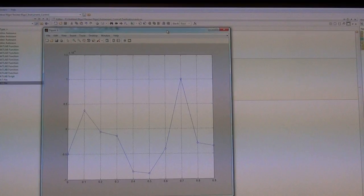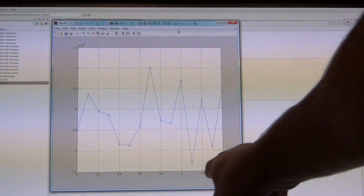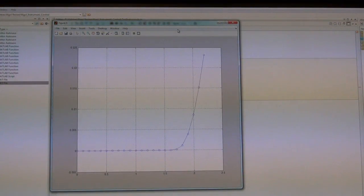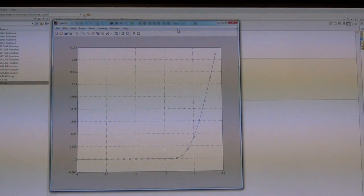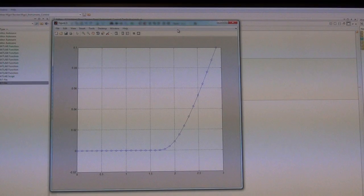And here we go. Make sure that you can see that. There it is. So now it's measuring current versus voltage. So this is voltage, it's now at 1.4 volts, and this is current. Right now it's a milliamp. There you go, the LED just turned on. So the exponential function is going up higher and higher. Right now it's 60 milliamp, 70 milliamp, 80 milliamp. The current is continuing to go.